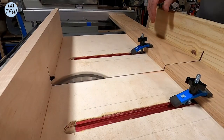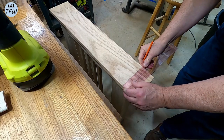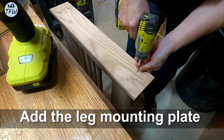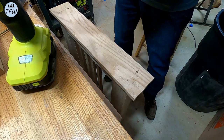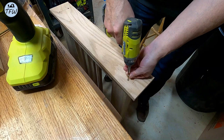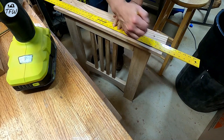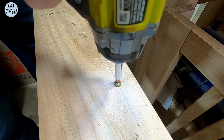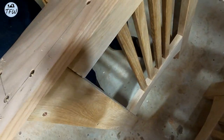Now we're going to move on to some additional support for the legs. I'm going to use a flat panel on the top of the legs, giving me an overall height of 28 and a quarter inches, and I will screw this down into the legs. This flat plate will be used to mount the leg to the bottom of the table. These are heavy-duty cabinet screws with flat heads on them, so with a slight indentation into the wood, they go down below the surface and allow me to put that bottom onto the tabletop flush.